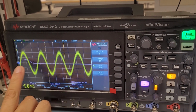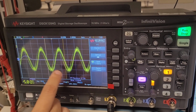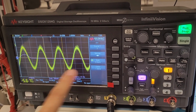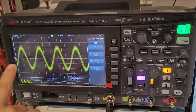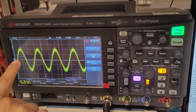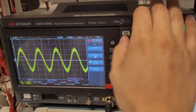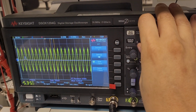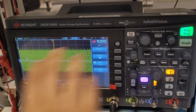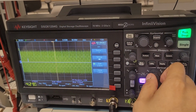And then if you want, usually the sinusoidal signal must have a line, not something like this. The reason is that this one is not a sinusoidal signal. This is part of a sinusoidal signal. So you will have an ideal spectrum the more periods you get. So if we do like this, you will see it becomes more spiky. You see the spectrum becomes more like a line because the signal yellow becomes more like a sinusoidal signal.